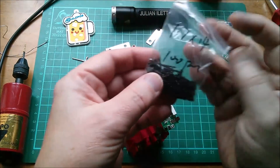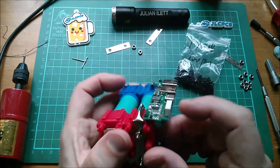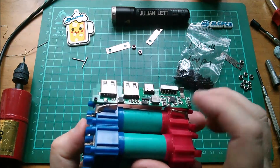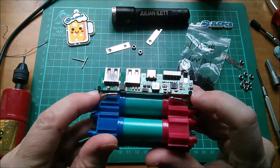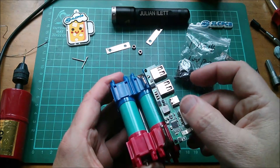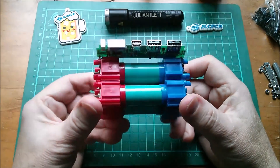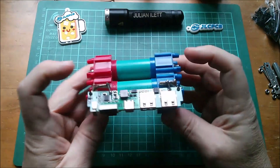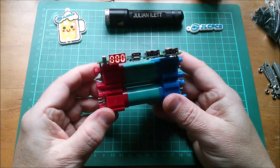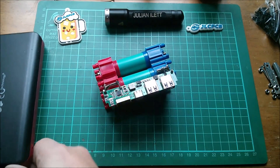In the end I found some very tiny 1.7 millimeter screws and my old drill with what looks like a 1 or 1.5 mm bit, and I drilled through the studs — these little supports — which just about spans the distance across the holes on the board. The screws fitted through the holes; it's loose but I'll put the wire links across first to strengthen it, and then maybe put a couple of dabs of hot glue underneath. Here it is — my little power bank with the wire links now soldered on. Touch the touch switch and it shows flashing zeros.